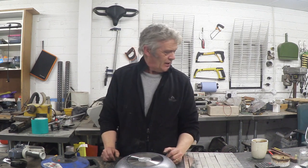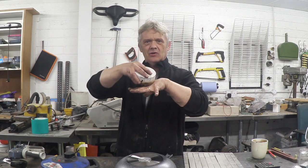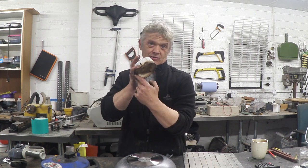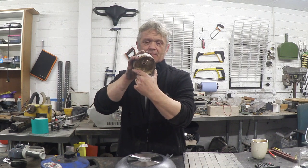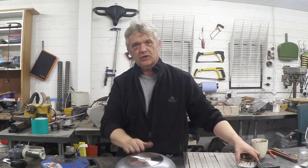How are we going to go about cutting it? I have these hole saws. If I put that hole saw flat on a piece it'll cut a hole, but if I cut it at an angle then I should be able to cut out a tongue and extend that tongue down to give me the metal that I want. There isn't much difference in the amount of metal that vibrates, and we can change that by changing the mass or the length of the vibrating tongue. We can grind a bit off to change the note, or not cut all the way around — cut it rough but leave a bit connected and extend that to create a vibrating tongue on the surface of this wok.